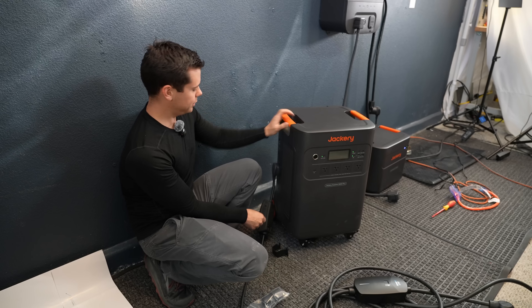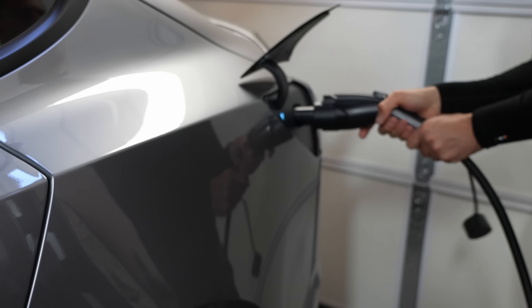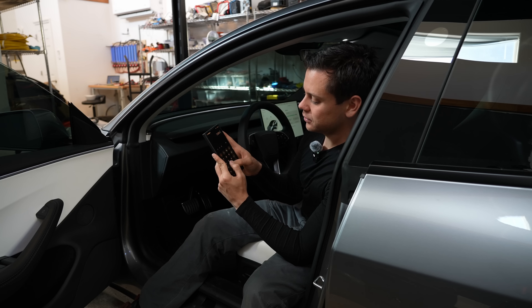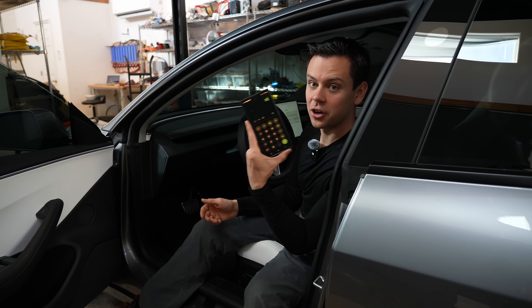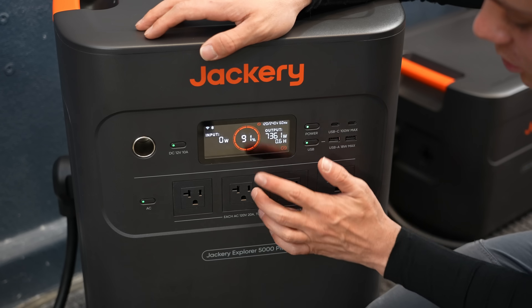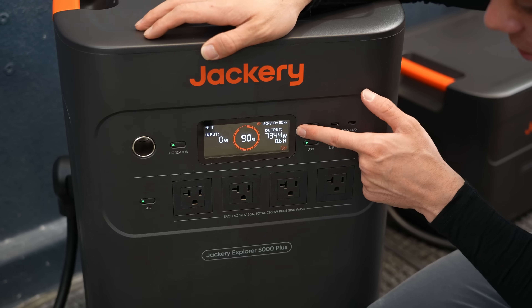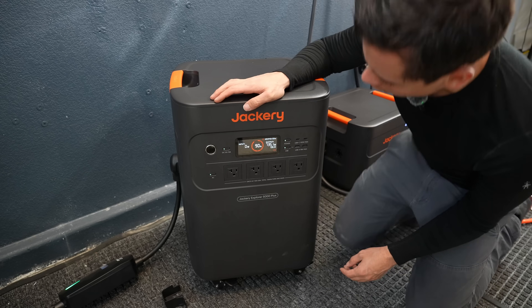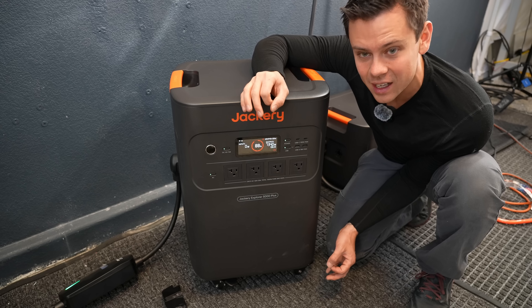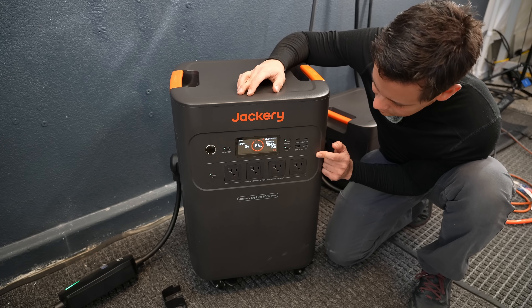After switching chargers, it's working. Taking 7,200 divided by 240 volts gives us 30 amps, so we set the car to a 30-amp charge rate — and it's doing it. We're outputting 7,300 watts. The thing is incredibly quiet for 7,000 watts — dead silent. This has to be the most quiet inverter ever tested, even quieter than a 12k PV.